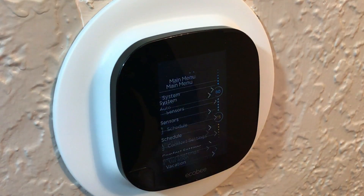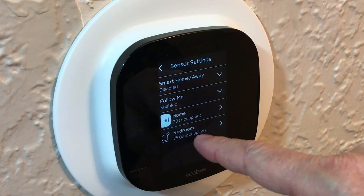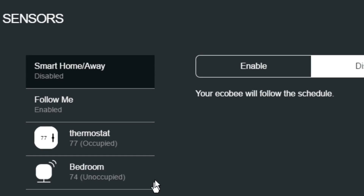The remote sensor is a multipurpose sensor detecting both temperature and motion. If you use the full features of the sensor, it'll calculate the average temperature of the thermostat and all the other Ecobee sensors to try to balance out the temperature in your house. According to the app, the follow me feature will average out the temperature only in the rooms that recently detected motion. I already have two more sensors on order and it's my understanding you can add up to 32. My house has both hot and cold spots, especially at night when the doors are closed — the master bedroom tends to run a little hot. So the first sensors I'm going to be putting in are going to be in the bedroom, and that should help regulate the temperature, save money, and help us get a good night's sleep.